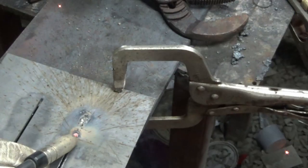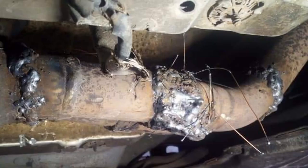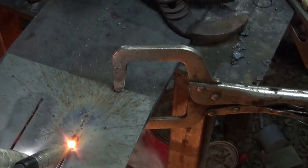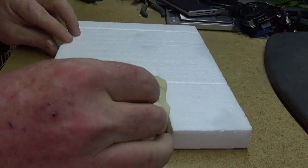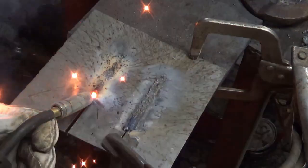Welding sheet metal is a pain in the arse, as most people who've ever welded car panels or thin wall pipe will testify to. So like before, clean up all your steel and get rid of all the contaminant. The machine I'm using is rated for 3mm plus sheet steel, but this is 0.9mm, which basically means if you try and weld it in a single pass, your MIG will become a plasma cutter and just chew holes non-stop. What we're doing is putting a little lump of molten metal on one side, letting it cool, then putting a small bead on the other side, letting it cool, and repeating — basically stitching up the hole. If you try doing it too fast, it'll just melt chunks out of the metal and open it up more than close it.